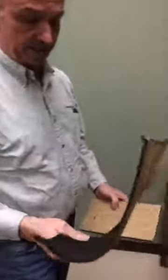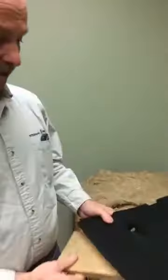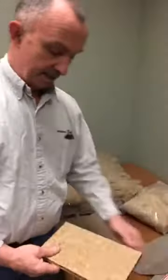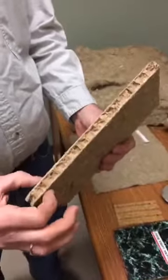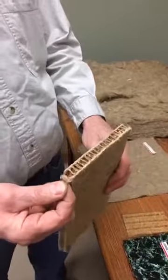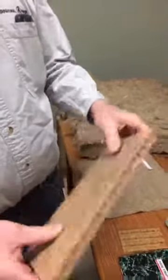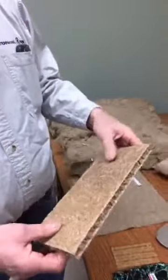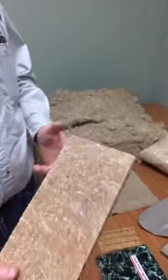We've taken this and started getting into the automotive business. I'm going to scan over here. You'll see these panels here. This is the first automotive panel made in North America out of hemp products. This is going in a General Motors car. You can take that one step further and start layering this. So these are two thin layers of hemp product with a kind of paper waffle. It's just very light paper, cardboard. So this is super lightweight and super strong, and this will be used in load floors in North American automobiles. This is under development, but very close to being commercialized.